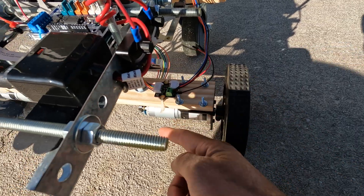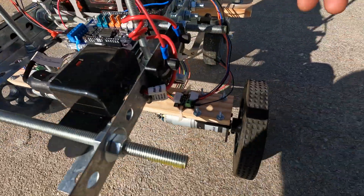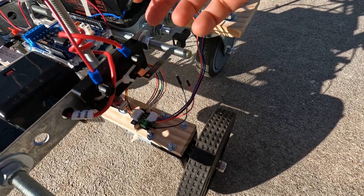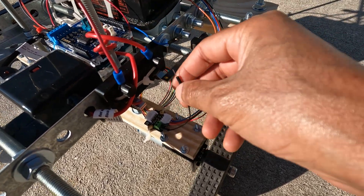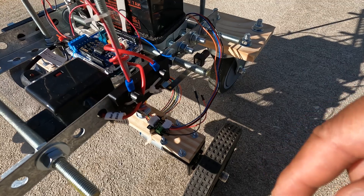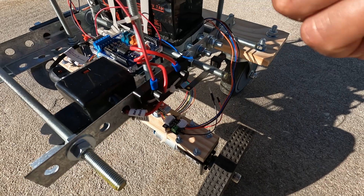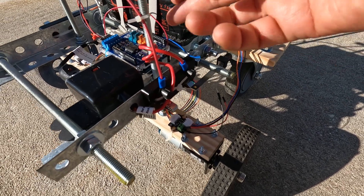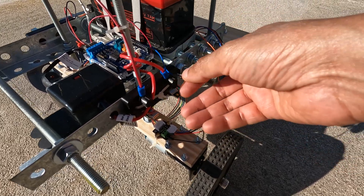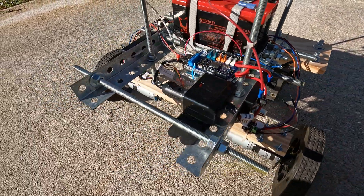The motor adapter is connected to the motors on each side. I wanted to also place a quick disconnect to the motors so that when I program the robot, the motor would not just automatically start moving. Once it's finished uploading the program from the computer to the microcontroller, I can connect up the motors and then the robot will move.